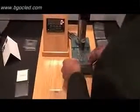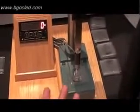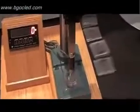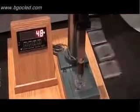I'll put it in this meter here. This is basically a lever press and it allows you to put some load on the glass and see at what point the glass breaks. Now that we've introduced damage to the glass, the glass has been weakened. 48 pounds — the glass breaks.